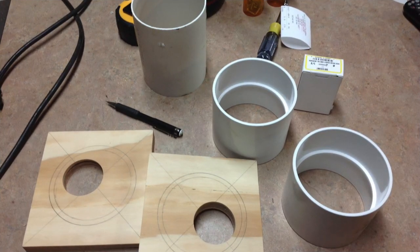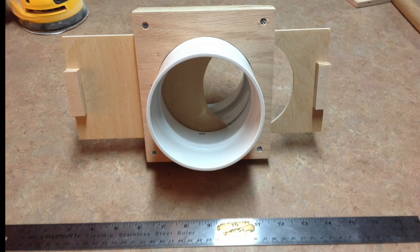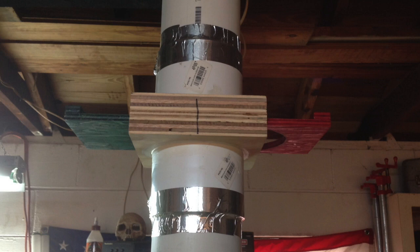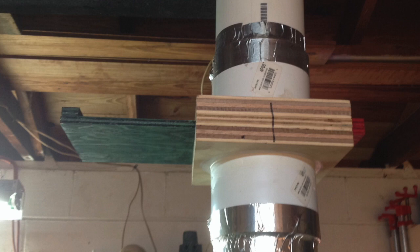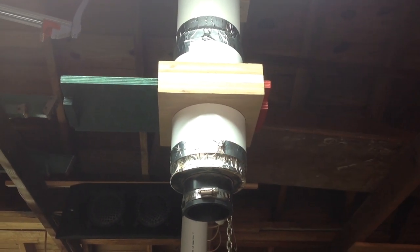As an added bonus I like to make my own blast gates. Some people use the pipe to connect into the wood; I prefer to use the fittings so I can just slide pipes into it — it's just simpler and you can connect or disconnect a gate if you need to move it at any time. Here's a fun tip: you can get your kids involved with this next part. I like to get the biggest Sharpies I can find — I like the Sharpie brand — and have my kids color the two sides of the blast gates. The side with the hole you color red and the solid side you color green. This way when you look at your blast gate you'll automatically know if it's open or closed — red light, green light. If you see a green side you know that one's open and you forgot to close it. Why Sharpies? Because they color the wood, and if you use paint it would clog up and stick and foul up the action of the gate sliding back and forth, whereas the coloring of the Sharpie does not.